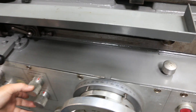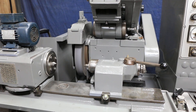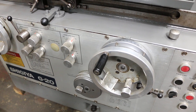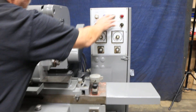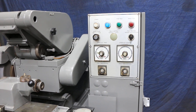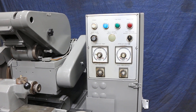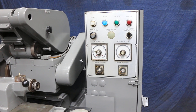There are two knobs here. The top one controls the coarse feed rate, and the bottom one controls the fine feed — once you reach the threshold set on the bottom dial. When you put the machine in manual mode and feed forward, the wheel head comes all the way down. You'll notice colored lights: the blue light indicates you're in the automatic cycle, and the green light comes on when you're at the fine feed.